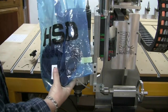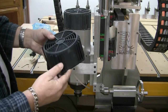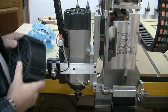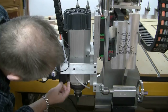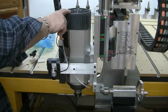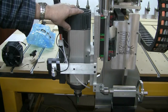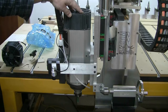Here's the new fan from HSD - I didn't actually buy it from HSD, I got it somewhere else. It's held in with four screws, a ground connector, and an electrical connector. These four screws pull the top off. The problem, apparently, is I've been operating without my dust boot. Here's your spindle - dust goes up into the square case, up into the fan, and that's what causes the fan to fail. This fan works all the time even if the spindle is not running - if there's power on the machine, the fan is operating. If it doesn't operate, you could damage the spindle.